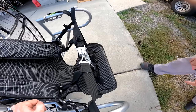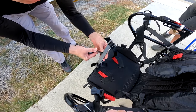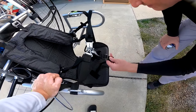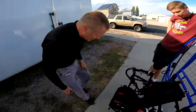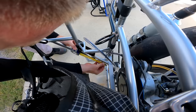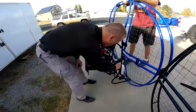There are no edges on the flat top — it's done by people who know what they're doing. These buckles are not right — they're not made as a set. You can see where they grabbed it, bent it, tweaked it — it's smashed in and stressed. The flat top uses actual certified parts, machined by factories that do all kinds of testing. This competitor unit is just slapped together in somebody's metal shop. The flat top's lateral support is four and a half inches — the competitor's is only two and three quarters inches.